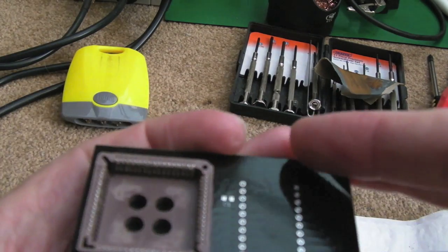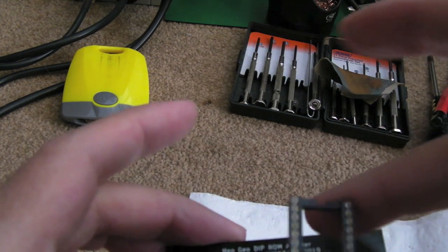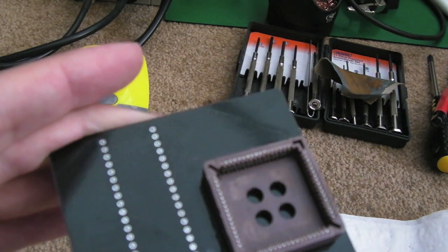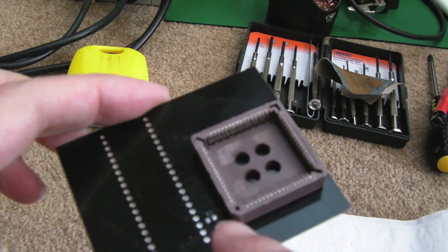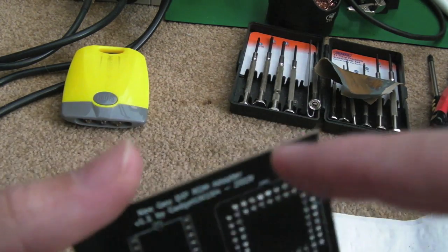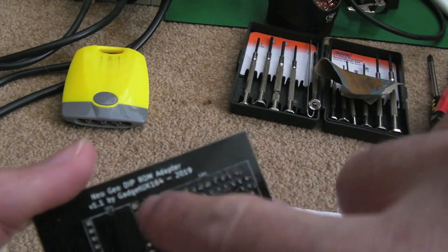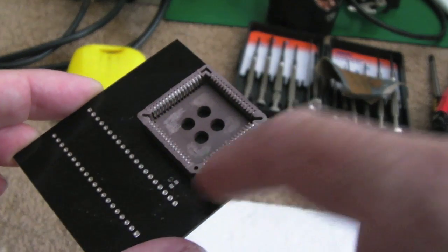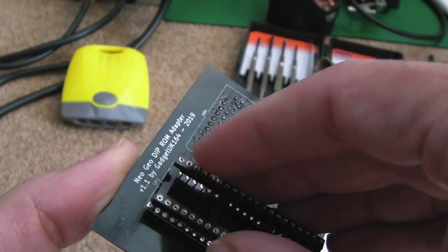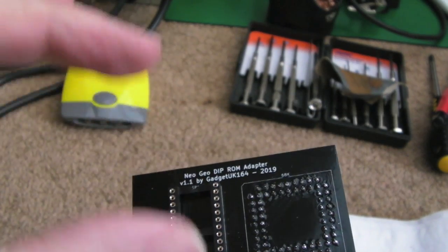So I've got the PLCC socket soldered on there now. The next thing we're going to do is get the ROM chip the right way around. Incidentally, I haven't got the profile of the chip on the underside here. I might revise the board and add that, but you can see the angled notches, the chamfered bit, and that corresponds with the same over here. So if you flip it over, we've got it on this side here and here. You can assemble these fairly easily once you've ground the socket down, then that's going to go that way up, and then the chip can fit in here.